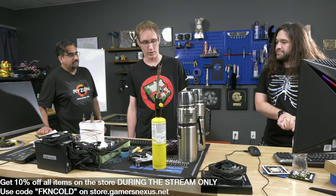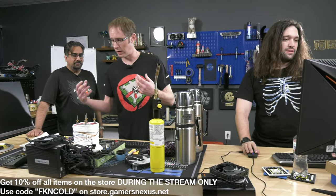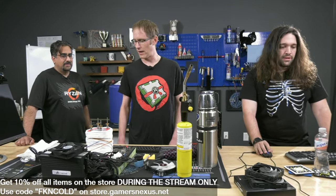Having water or ice in the pot is bad because it insulates the metal from the LN2 and gets messy. When you pour in fresh LN2 it boils rapidly and can kick ice out. Once we get cold and ice naturally starts to form from condensation, I'll blow out the pot and ice will fly everywhere.